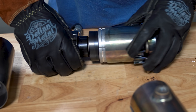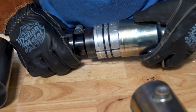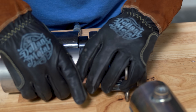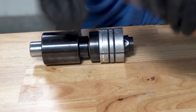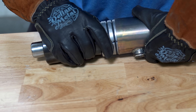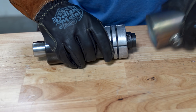Cleanliness and fit-up are probably the biggest killers of people attempting titanium fab or repair. I noticed the original part had some distortion in the tube which made it a little out of round — we can't have huge gaps in our fit-up; you'll see how much of a pain dealing with a hole is a little bit later. I grabbed my swager tool to see if I could just barely get these to true up, and it worked out quite well.